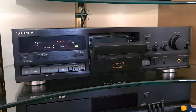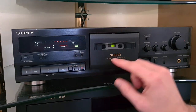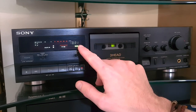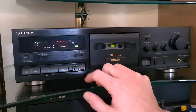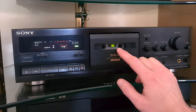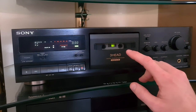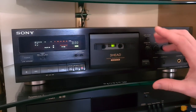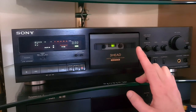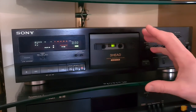As you can see, the door opens electronically - that's one motor. If you have a fault where your tape runs fine but something's wrong with the door opening, generally it's that motor, or really that belt. I've never seen one with problems with the logic control buttons - I've never had to clean or replace any buttons, and I've probably serviced maybe 25-30 of these. If something's not working, generally it's the transport that's at fault rather than the buttons. If I fire a type one tape in there, you'll notice it's selected type one and puts a little wind back on the tape to make sure there's no slack.